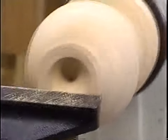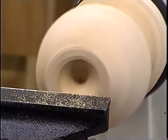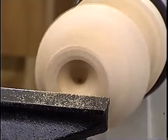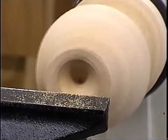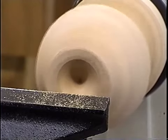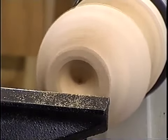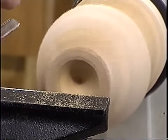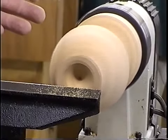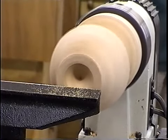There are several styles of gouges that you can use on the lathe. Bowl gouges. There's a 1/2-inch gouge, a 3/8-inch gouge. Depending on the size of the piece, of course, is the size of the gouge, but with the bigger gouge, once you're hollowing, it tends to take a lot of wood at once, and if you've got a long piece, it doesn't take much stress to draw down a line.